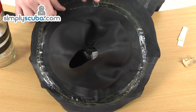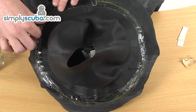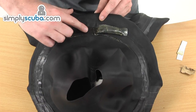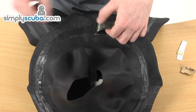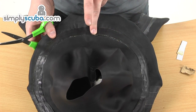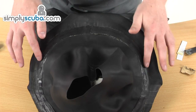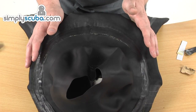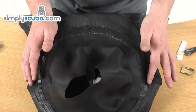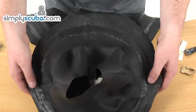Give it a bit of a pull as you slowly start to put it on, and give it a gentle curve as you go. We've finished wrapping the tape around the top and glued about half an inch just over the start of the seal to get an overlap. Trim off any excess at the top and push that section back over. We've tried to centre the tape over the seam to make everything line up. There are areas where not enough glue was applied — slight flaps on the inside — so we'll go around and touch up a little bit of glue underneath those sections.